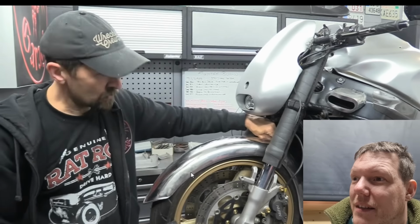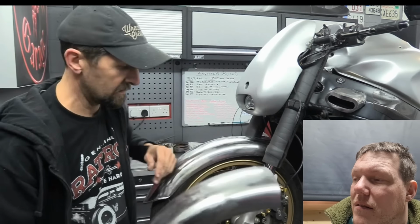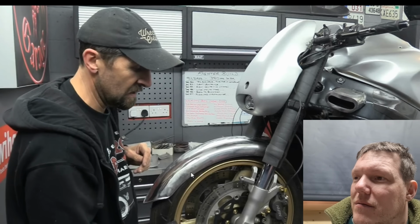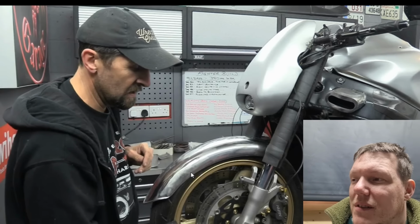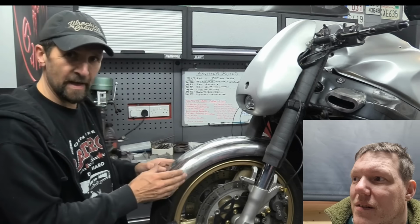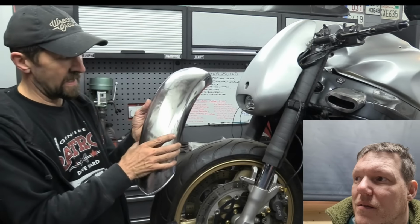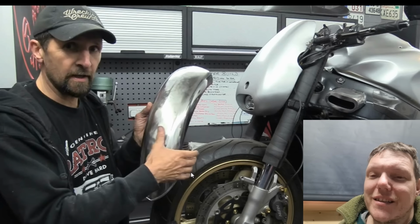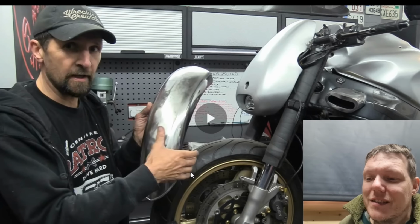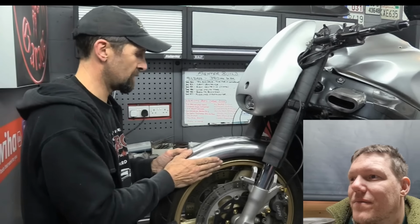So I've now got all of the material I need. I can cut from this middle end, you see. I can just chop any of that back to make it the length it needs to be. If you chop it in half, then you can shrink them, but it just seems stupid. It just looks right, I can do that later on. I just needed to make the basic V in it. It has narrowed in a little bit with the welding. The heat of welding that in has drawn the curve round slow. I said that if you pull it in, it's going to tuck in slightly more, so I've got to bend that out a little bit. It's all for later on, just details, not a big issue.